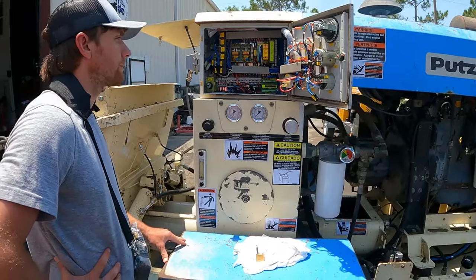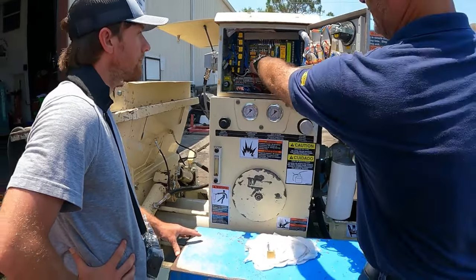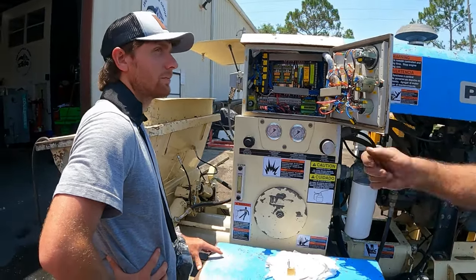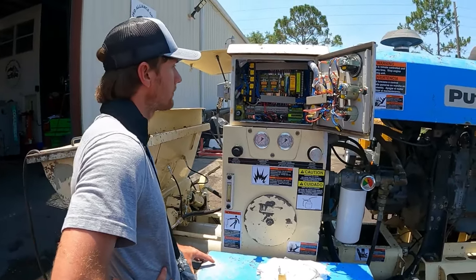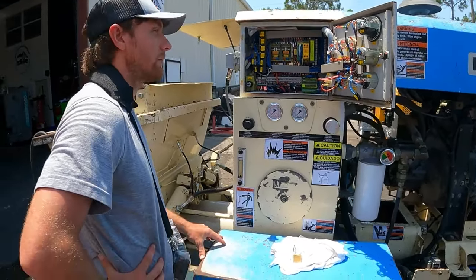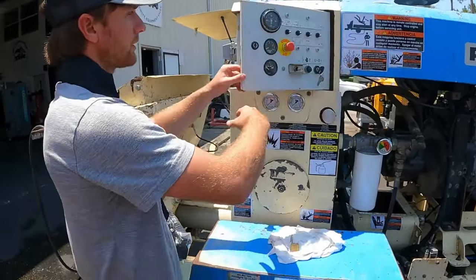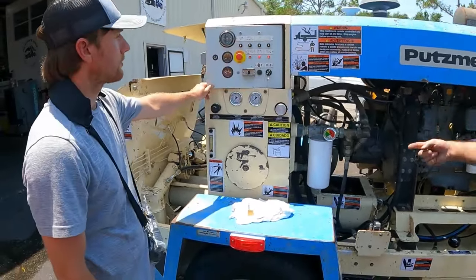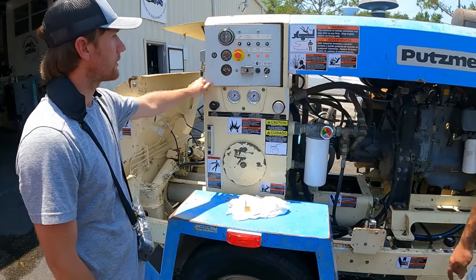Correct. So there's actually a relay in here. You can see there's an orange relay, and the direction is correct. So if you take it out upside down, you put it in upside down. If you put them in wrong, of course, it won't initiate. So that's what it does. The POF card changes from an analog signal to a digital signal, so K23 is going to be it.